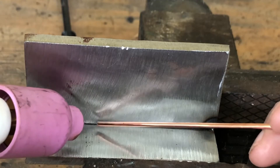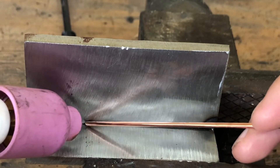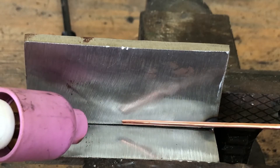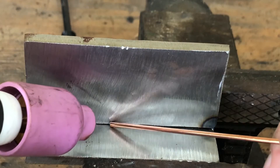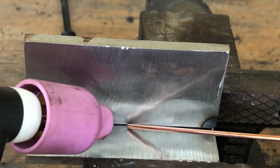When you fire up, you want to make sure you get a little puddle going. Make sure you're melting your plates first, and then you start adding a little wire. You want to make a back-and-forth motion, top plate to the bottom plate, slowly. Make sure your puddle is wet all the way down into the joint.